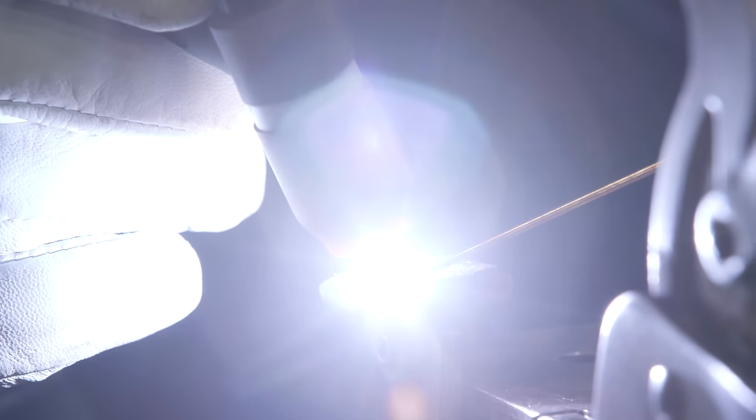Okay, that was the first course — we're going to go ahead and put a second one on now. We're just doing a surface build-up, so we may end up doing one more course after this. Just want to make sure we add enough material on there. It doesn't have to be anything fancy — just need to get that thick coating on there. Don't be afraid to push that filler metal all up in there. And if you don't have a TIG torch, you can also do this with oxy-fuel.